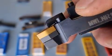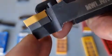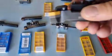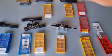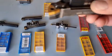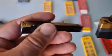This is the one they use a lot in industry. You've got massive support underneath — there's a little bit of clearance there, but if you put a straight edge against it you'll see how much. The downward angle gives negative rake. Your finish isn't as good as positive or neutral rake, but it's pretty close — and especially if you're going to use it for roughing, stripping off bulk metal. I've seen brilliant finishes using those. It all depends on the tool steel, speeds, and feeds. For the price and durability, this type of carbide bit is going to outlast that other type probably tenfold.